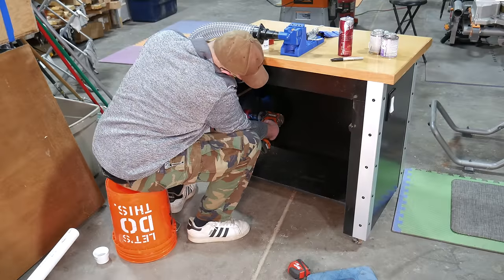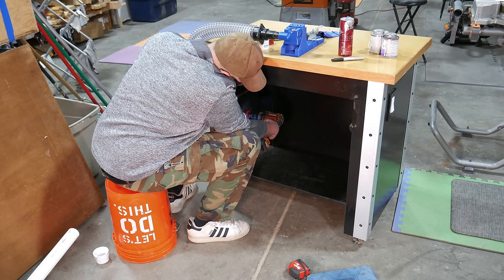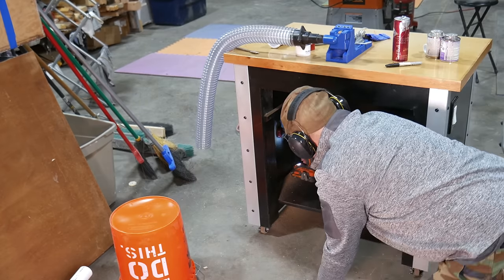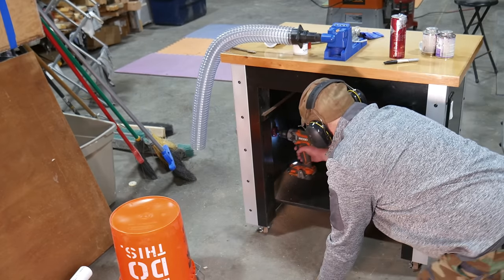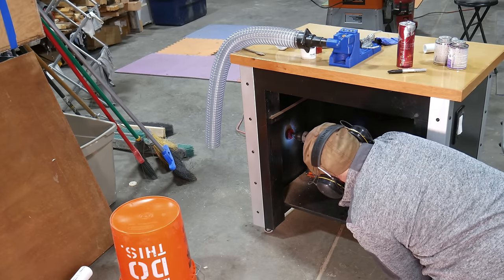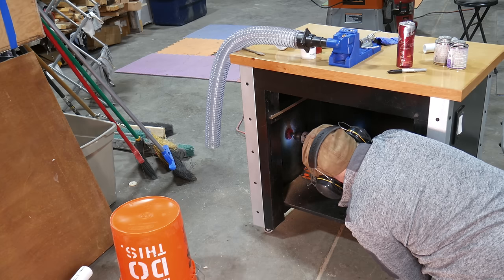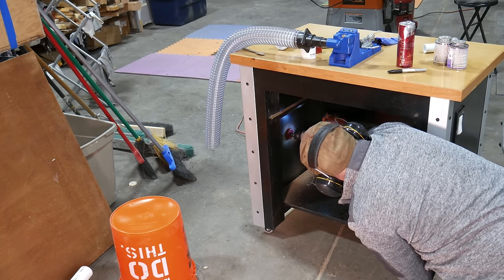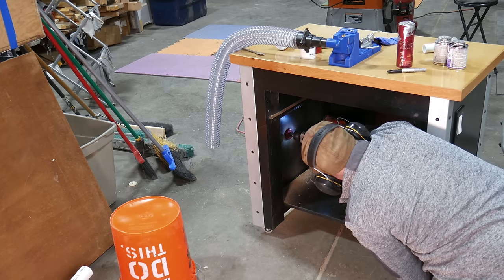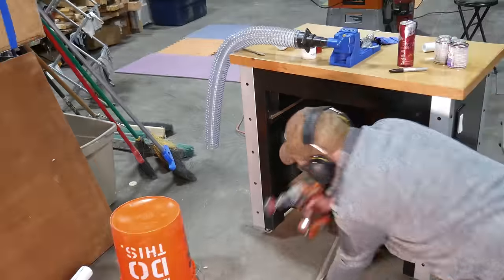Let me slow things down here for just a moment. I don't know what I was thinking drilling a hole with a hole saw from the inside out on a cabinet made out of plywood. More often than not, when the hole saw blasts through the other side, it will cause chip out of the veneer on the face of the plywood, which is exactly what happened here. It's not a big deal — I was able to repair the chip out with a little bit of wood glue and paint. I have no excuse, especially since I made a video a few months ago with tips on how to properly drill a hole with a hole saw by drilling both directions to prevent this very thing. If you want to learn how to properly drill both directions with a hole saw, click this link here.